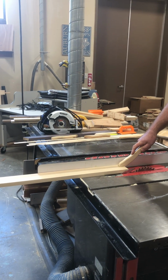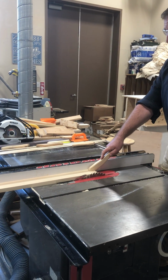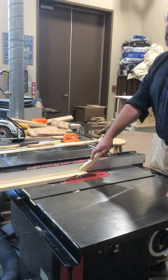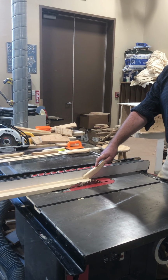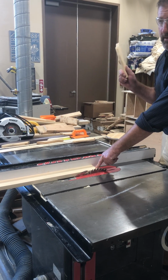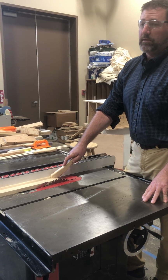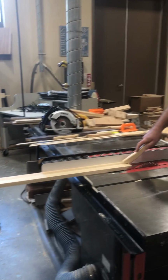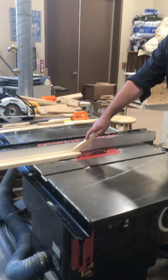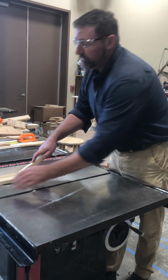Make sense? Now, lastly, when you're cutting, you're going to get to this point right here. The board is going to be completely cut through, and typically kids stop cutting, stop right there, and they pick this up. What I want you guys to do is get it past the blade, all the way to the back to there, because I don't want you to depend on the person catching to pull it out. I want you to be the one to control that, all right? And that brings me to my final point.